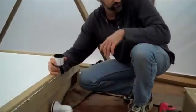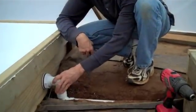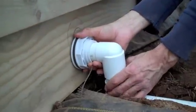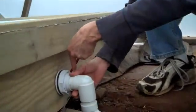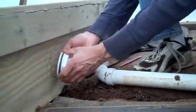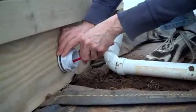So what I've done is place my pipe into the hole - everything's just fit together, not glued yet. To find the position that I want my bulkhead, it's going to go right there. So what I'll do is mark the outside where I want it. Now I have the outer ring traced. I can remove this, take this off, move the pipe out of the way, line that up with the outer ring, and draw the inner circle right there.